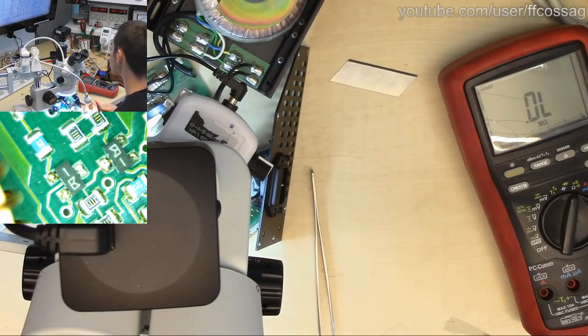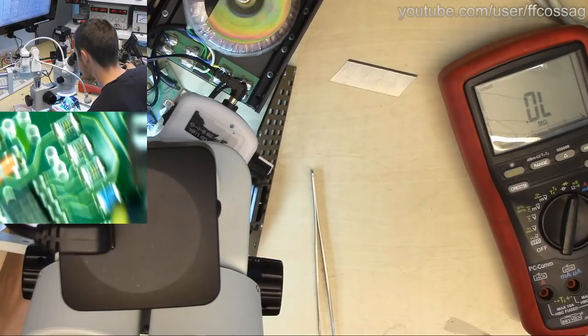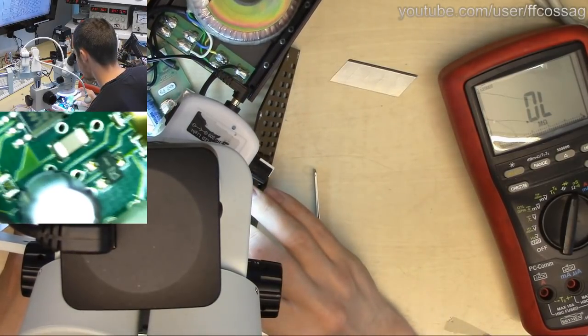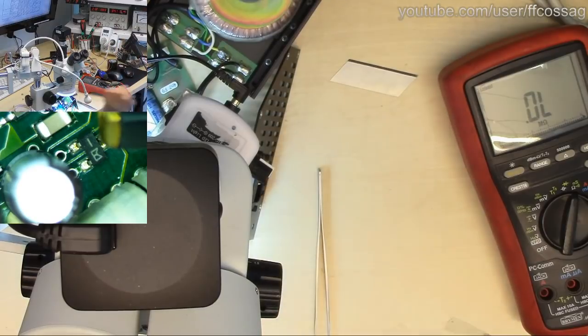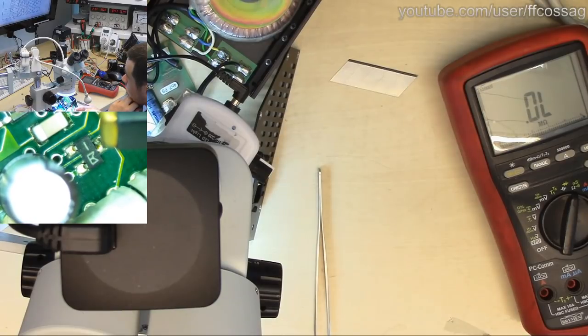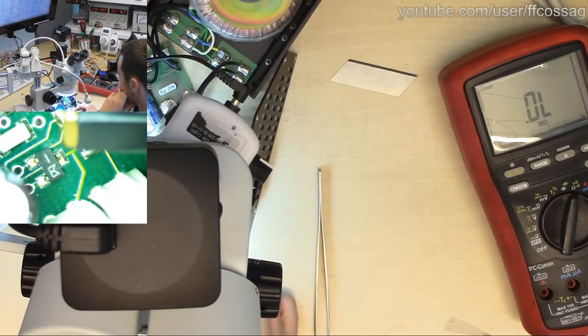So that's going to be controlling, I'm assuming, what if this IC puts out a reset signal. I'm not sure what the reset signal is for. It runs off through a bunch of stuff going to a few pins over here. That means that this device is able to reset equipment depending on an input here. So if we have malfunctioning equipment somewhere else that's causing that to trigger, it would easily seem as if this device is the culprit.